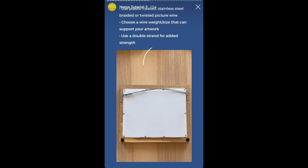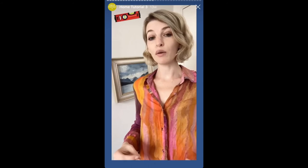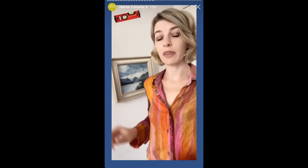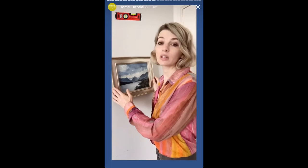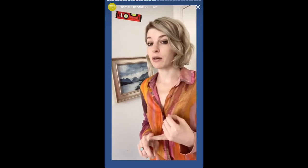There are many types of wire, but the best option is braided or twisted stainless steel picture wire that is plastic coated. Multiple strands of steel together make the wire stronger, while the plastic coating won't hurt your hands during installation, mar walls, rust, or discolor over time. I don't have any plastic coated picture wire at home, but that is what you want to look for. This method is a little bit less stable than the previous method in that the picture wire allows it to come out of level, but the good thing is that it's not going to come off the wall anyway.